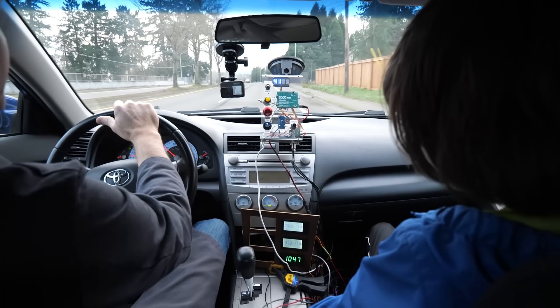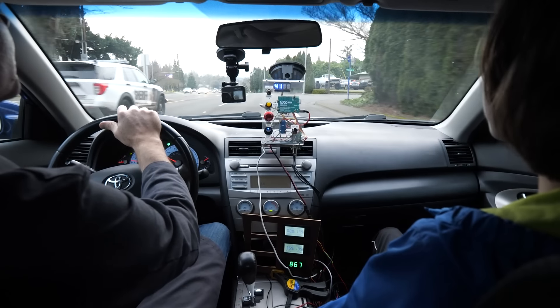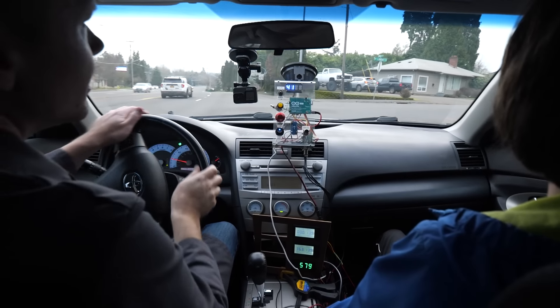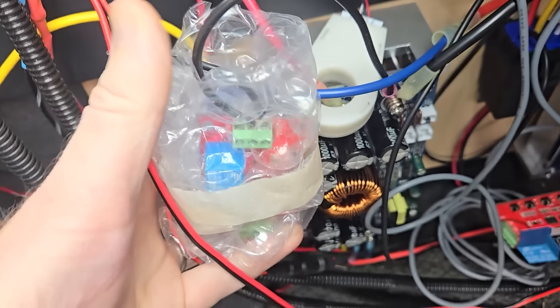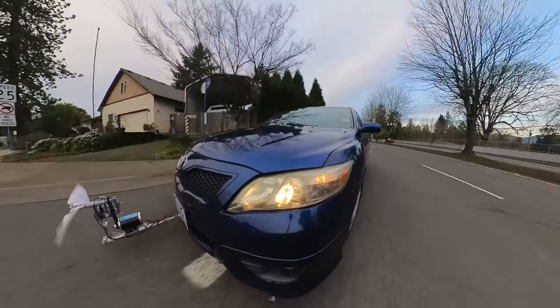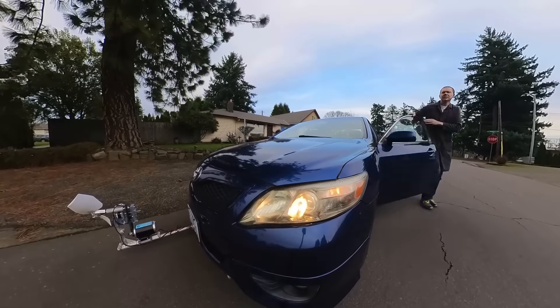What isn't normal is the speed of the turbine we're suddenly getting with zero power output. It turns out a wire came loose resulting in no electrical connection between the turbine and car. No load means no torque, so the RPM can spike as high as it wants, just as if the pulleys were slipping again.